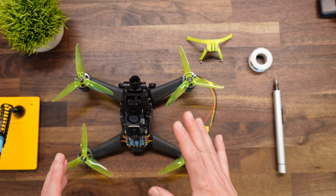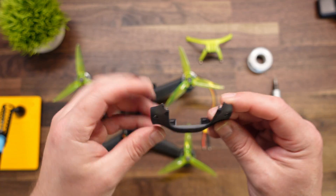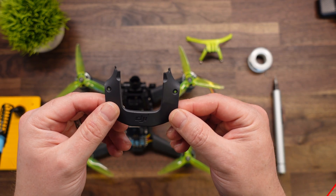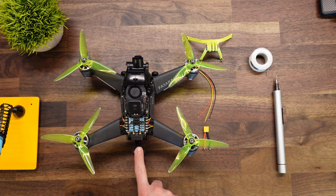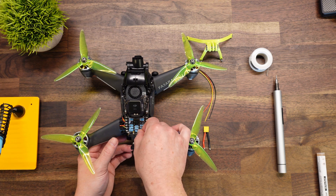While the soldering iron heats up, we also need a hobby knife or a Dremel tool — we're going to take two small notches out of this cover plate so the wire can go through. Make sure your battery is not connected while doing the soldering work; you don't want to short anything out. First, I'd suggest cleaning these two contacts with rubbing alcohol — 70% or greater isopropyl — to remove any grease or dirt. I'm just going to use an alcohol prep pad; I always have those handy.